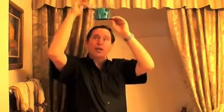This box will allow us to make approximately a four-inch diameter hole in the ceiling, reach up and pull the wire down into the room, and then replace the box in the place where we just made the hole. Pull the wire down through here — it gives us a great way to secure the fixture to the ceiling for a very professional installation.